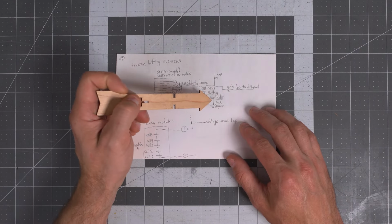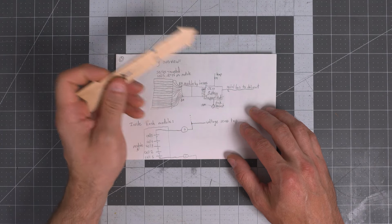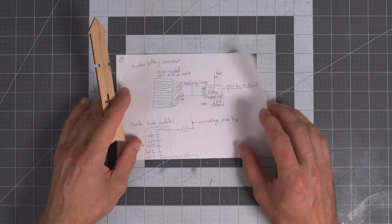So this battery support unit then goes to 4 temperature sensors. It measures pack current. It also does things like the HVDC isolation bus. I didn't draw that on here. And then it just has a serial bus. It's just an RS485, like a differential bus that it sends to the drive unit.